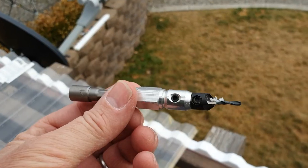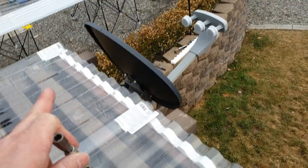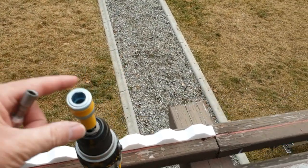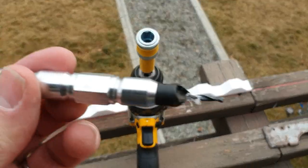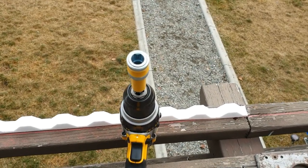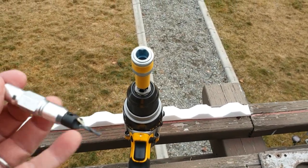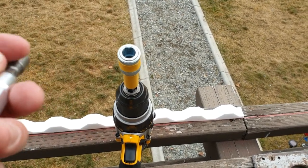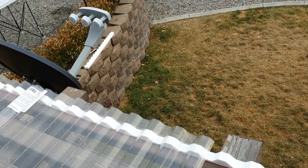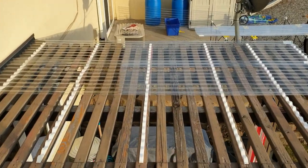One really important piece: you've got to drill pilot holes in each panel rib so the screws go in properly. I use this little DeWalt combo tool — pull the bit out, turn it one inch, and you've got a quarter-inch hex head that fits the screw on one side, and a pilot hole bit on the other side. You just keep flipping it over — drill all your pilot holes, flip it, put in your screws. Real simple.